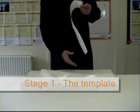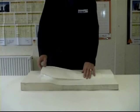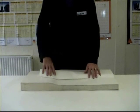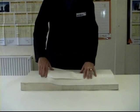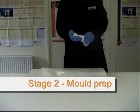To get started, a good tip is to cut out a paper template first to the shape of the part that you want to produce. Allow about 10mm extra around the edge of the template to ensure that you'll cut out enough carbon fibre to cover the part. When you've done this, just put it to one side for later.